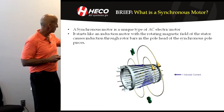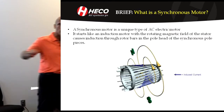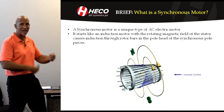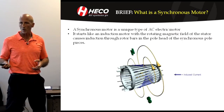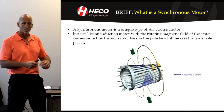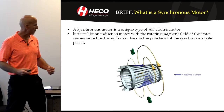In that basis, what happens is that rotating magnetic field — the lines of magnetic flux cut through the rotor bars. This is just a squirrel cage. It induces current and it causes that cage to rotate. That's the basis for an induction motor, how it operates. Induction motors have a barred aluminum or copper alloy.